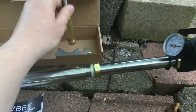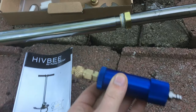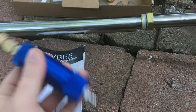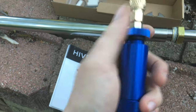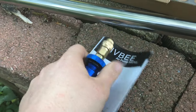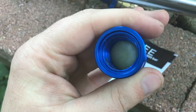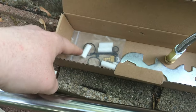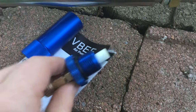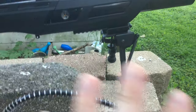To fix that problem, you use a water separator. I picked this up on Amazon for 15 bucks and it did the trick — it separated the water. There's actual cotton balls in here — you unscrew it and there's cotton things inside. What that does is it separates and keeps the water from going into your gun. It comes with little inserts that you push in there, and it just keeps all the water out of your gun. I had no more water going in my tank, no problems.